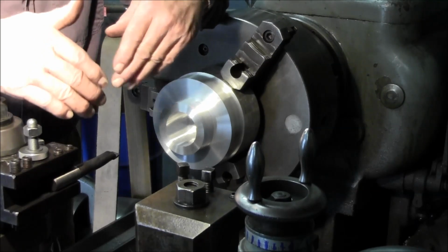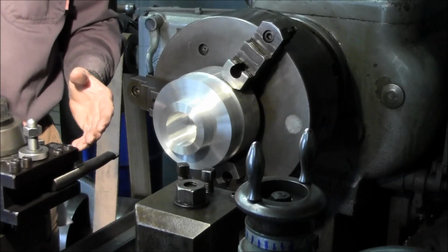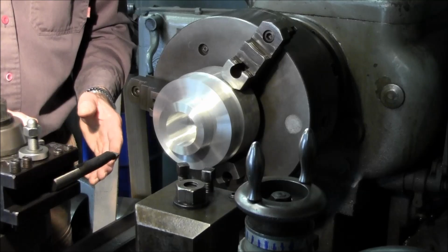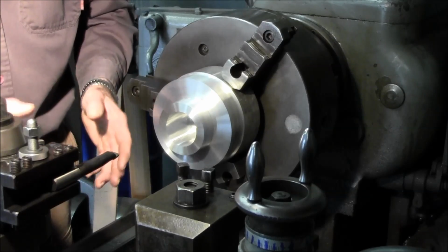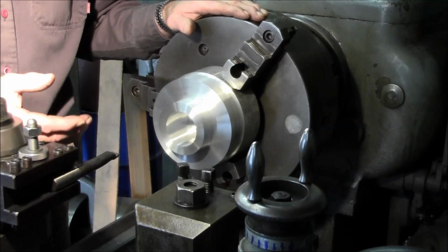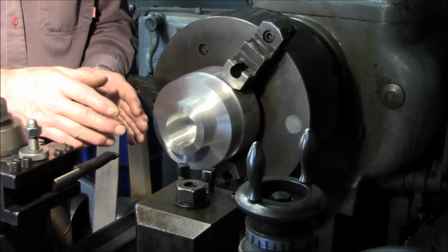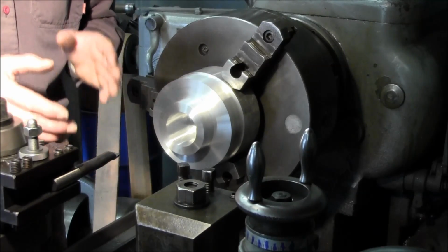And knowing your machine and how you run your machine makes it cut the way you want it to cut. And whenever they talk about idiosyncrasies or compensations and all of that, or machine wear, those are all factors that got to be in play there. Now they develop machines that automatically take out backlashes and all that kind of stuff. But old conventional machinery does get wear, and you got to adjust how you run the lathe. Don't think that just because you dial it in that it's going to be actually there, and you want to adjust your tooling so that you're not going to be sucking bits and a lot of different things like that.